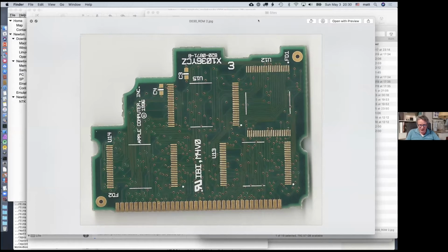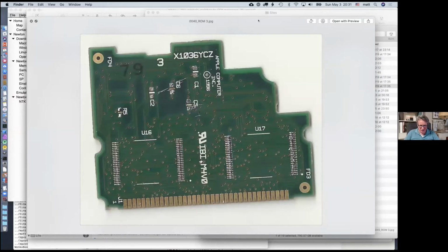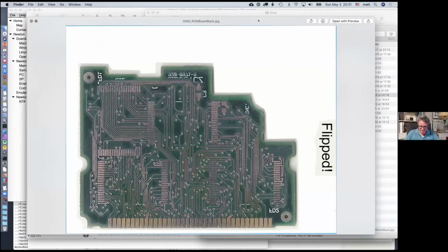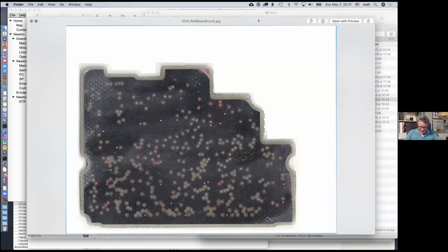So I got really curious, and I wanted to know what those footprints do. I started to desolder the ROM chips. Then I took some sandpaper, and I took all the paint off the top of the printed circuit board to get to the copper layer. I made a scan of the copper layer of the front side and of course the back side. And then I saw that this was not all connections. So this is a 4-layer board. So I took off more of the PCB